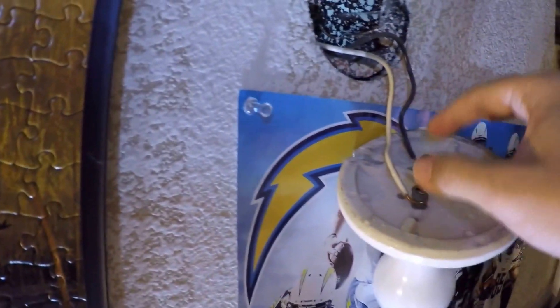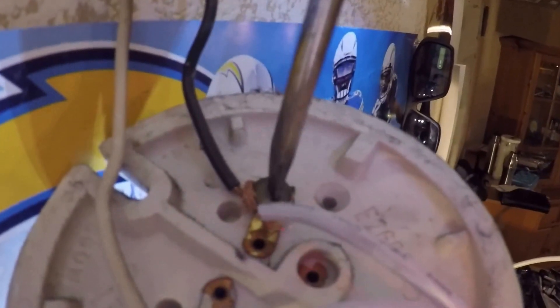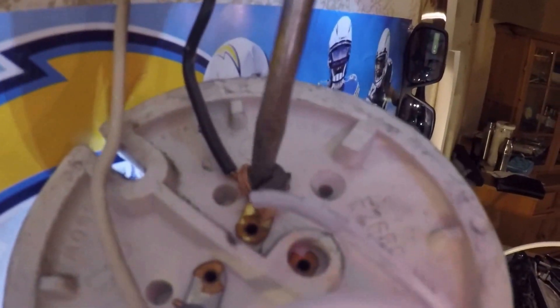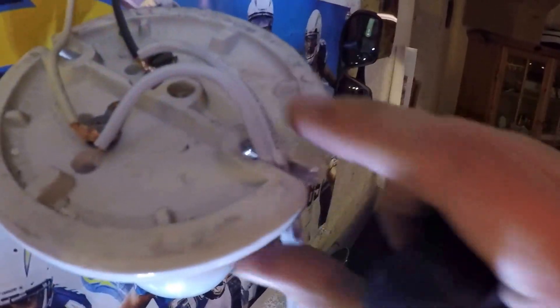Now I can safely touch the wire without being electrocuted. Simply loop your wire around the screw, then tighten the screw. And also on this side, loop around the wire, make sure you have good contact, then tighten the screw. You should also put some tape around on this side to provide some stress relief.